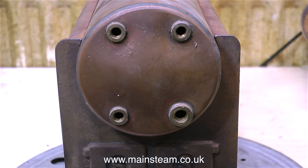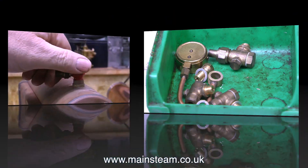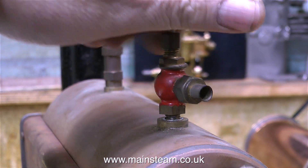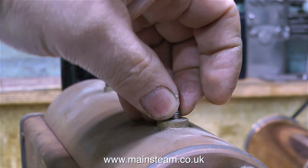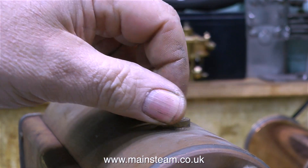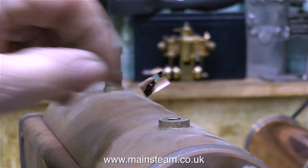Just a bit of tarnish on the metal. I'm putting these parts into a green plastic box as usual, and I will clean them all up using my polishing spindle, then finish the job off with some Brasso and a cloth. Stuart Models have always had a very odd arrangement for taps, and I suppose it's quite clever. However, this is a stainless steel insert — what you've got to be careful of is you don't screw it too far into the boiler bush, but then again it's not very tight, so it comes out.